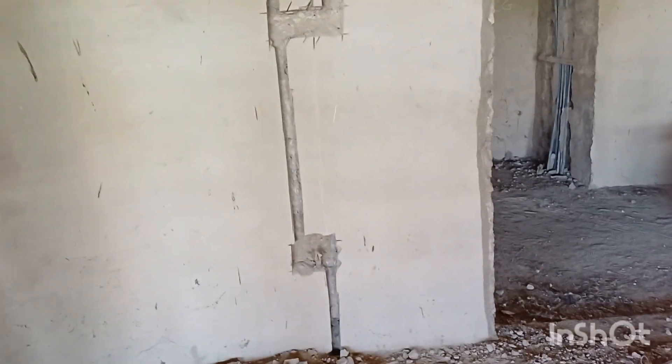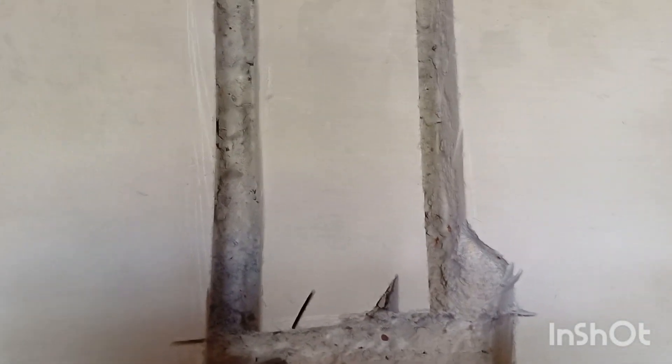We have to make the heights uniform, so we are going with 18 and a half inches. That's why we've taken out these already-fixed conduit boxes to rearrange them. There's also an additional conduit box and socket outlet for the video intercom right there.